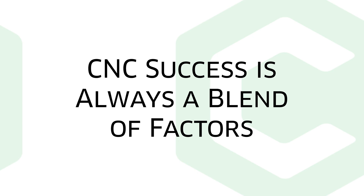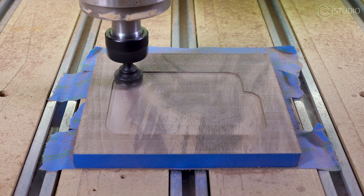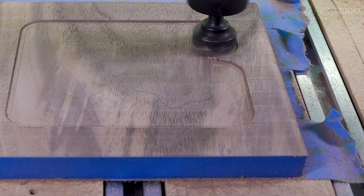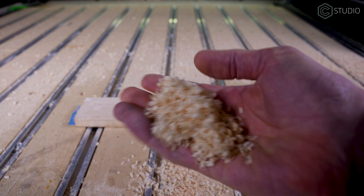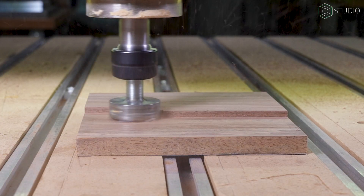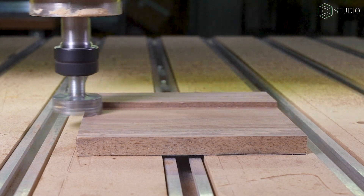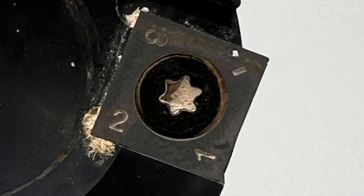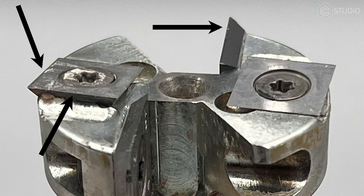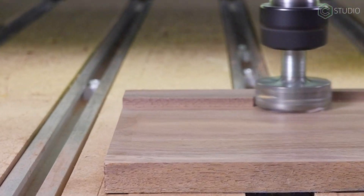RPMs are not the sole issue you might encounter. If you have burning in the corners, try upping your feed rate. Or utilize the facing toolpath so there are no corners where the end mill has a momentary change in direction while engaged in the material. As with any cut or end mill, you should be seeing chips, not dust. The size of the material coming off directly relates to your feed rate. Finally, check your inserts — be sure they are sharp. These are indexable and replaceable for a reason. Dull blades equals friction no matter the tool.